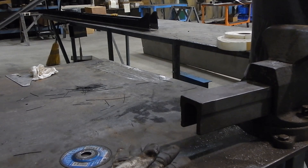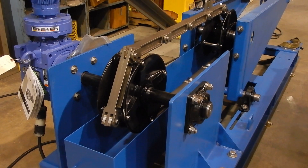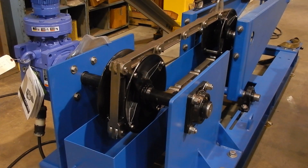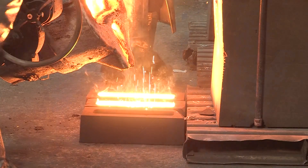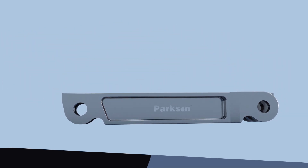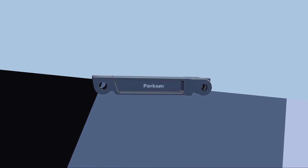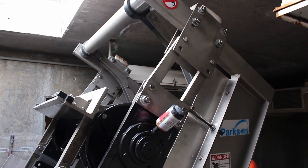Next comes strength. That is a 5.5-pound cast chain link — almost a pound heavier than the industry standard — which gives it a 70,000-pound ultimate strength, a 10,000-pound higher rating than any other out there. The chain links of the Cayman are cast solid, then the pinholes and radius are machined out, which adds strength over the standard methods utilized by other manufacturers, in which the pinhole and radius are cast. The head of the drive pulley is manufactured in the same way: cast solid, then machined.